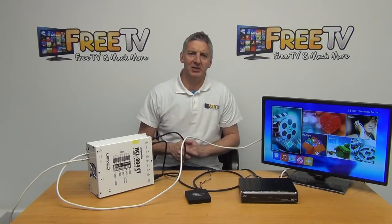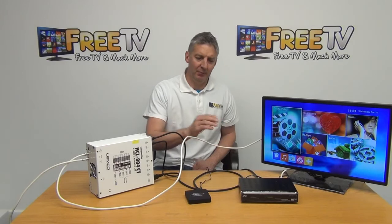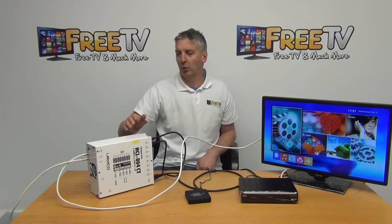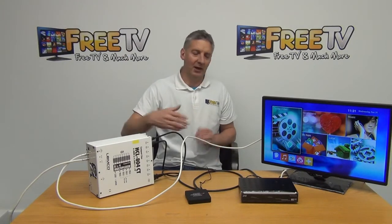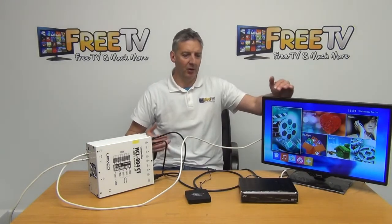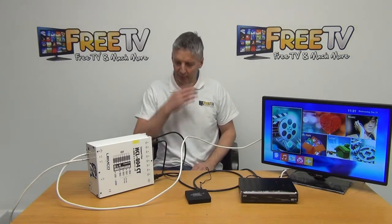In this video on the Lemco HDL804CT digital head end, we're going to set this up working with two HDMI inputs. The first is a combo receiver and the other is an Android box. Both have HDMI leads feeding into input 1 and 2 on the unit. We're also going to combine in a UHF aerial input bringing in a DVB-T signal — in this case from Saorview high definition, but it could equally be Freeview high definition. We'll display it working on the local TV here, which is taking a DVB-T input via the local tuner.